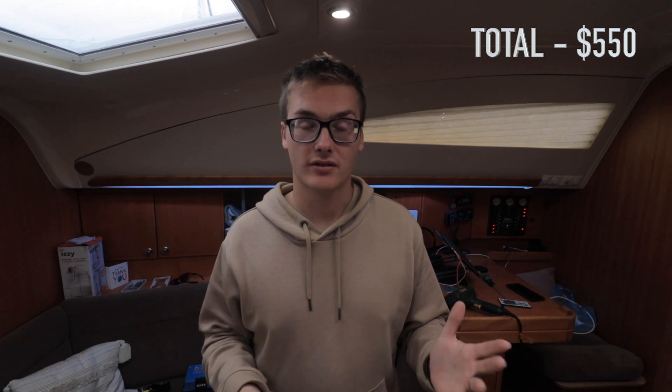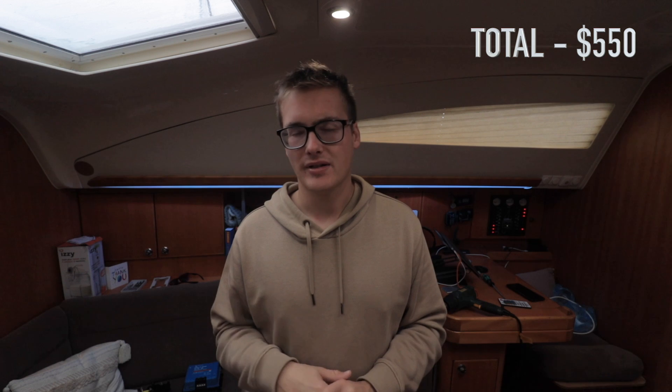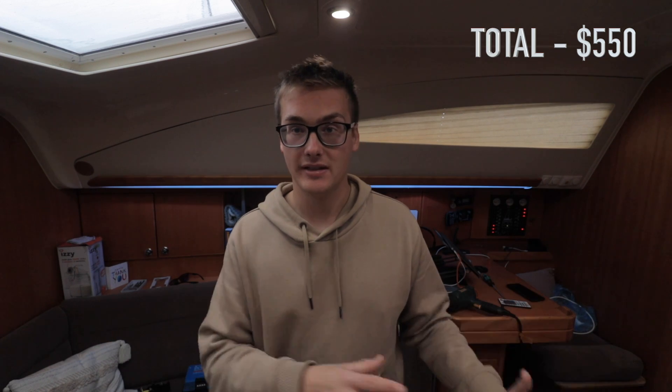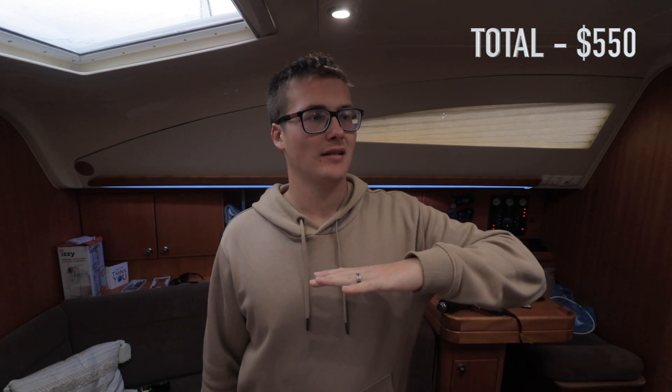Back to the saga of charging. You need to be really careful with lithium when charging from shore power and from your alternator. There are two main ways to get around this problem. The first is to buy a specific lithium charger for shore power and a specific lithium alternator — the most common one is Balmar — but these are very expensive and hard to justify. Yes, you might get 100, 110, or even 150 amps from your alternator, which is incredible, but if you get virtually all your power from solar it's not really worth the thousand dollars-plus these new alternators cost.